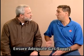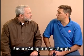So you may need to check to see that your gas supply is adequate. In fact, depending on which model you choose, you're either going to need a one-half inch or a three-quarter inch gas supply line. We always recommend you consult your local gas utility to make sure that your gas line is sized properly.